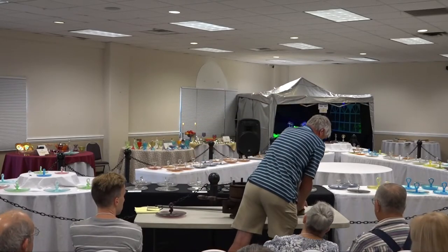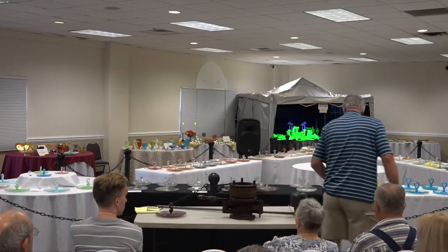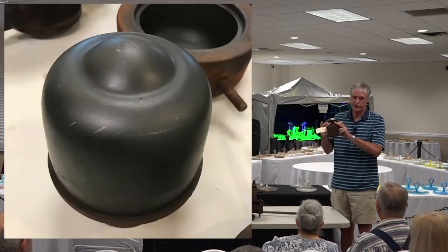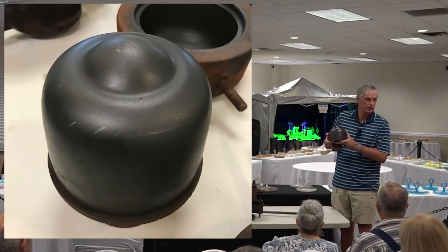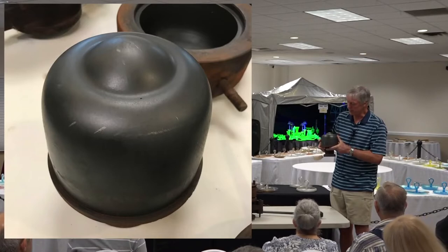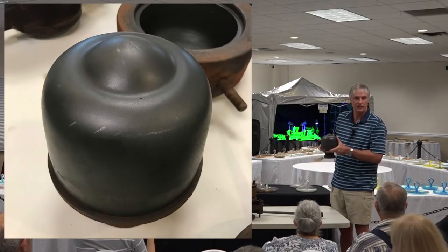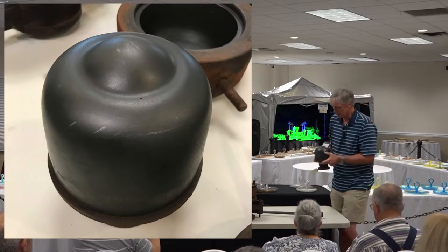Okay, this is the plunger. Let's see, get over here. I don't want to hold that up away from me. But you can see this part is attached to the press. This smooth part is what comes down inside the press, or in the mold, in order to press the glass out into the outside. It's got a little nipple on the front of it, which reduces the weight that's in the bottom of the handle to make it set up faster.